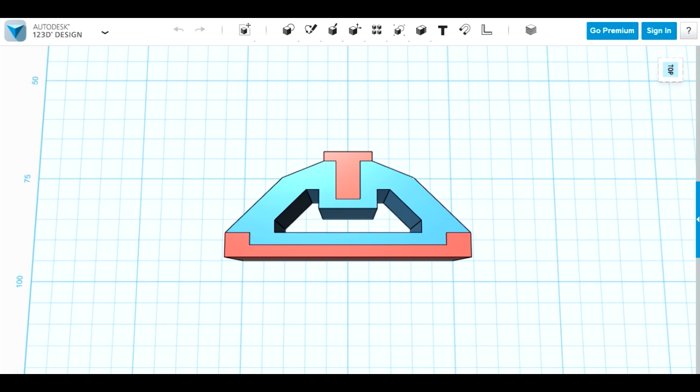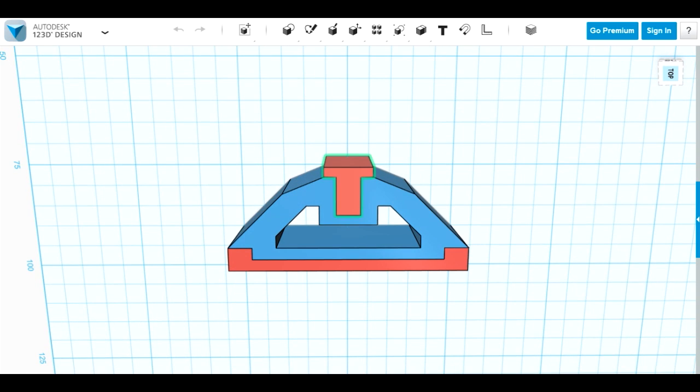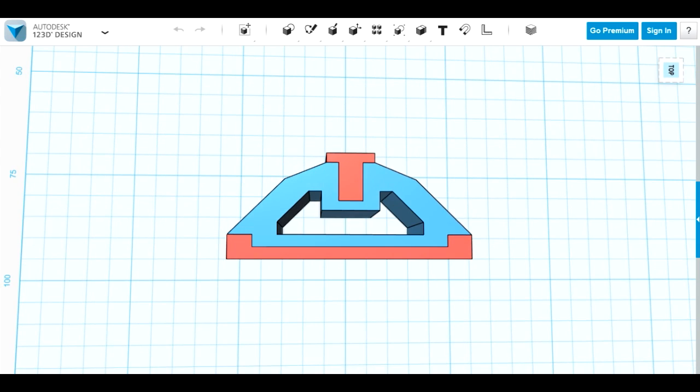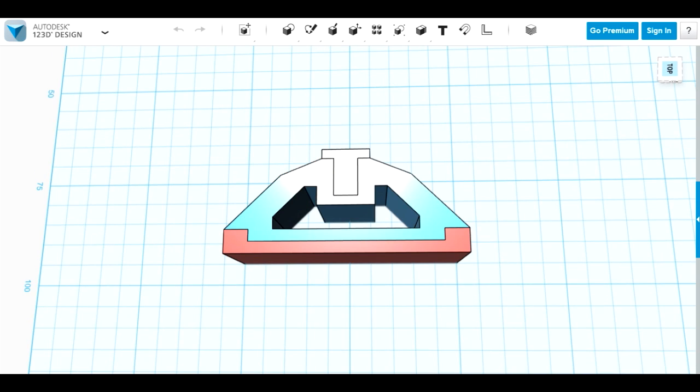The switch fits in the cavity right in the middle. The hip pod is bonded to the red T-shaped piece on top and we can weld that on with acetone — a chemical weld since both materials are ABS. The red plate at the bottom mounts onto the next piece, which attaches to my hip. The blue rubber part is squashy, so as we press down on the hip pod we can depress the switch. Let's get a couple of those printed off and see how well it works.